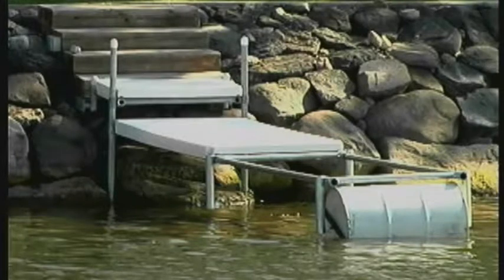You will need to take into consideration the starting height of the dock above the water. This starting point is 26 inches above the water because the wall height here is 4 feet. High steps were needed along with an additional step and a second starter bracket. In most cases, only one starter bracket is needed, and the first set of the frame pipes will slide directly into the sleeves of the starter.